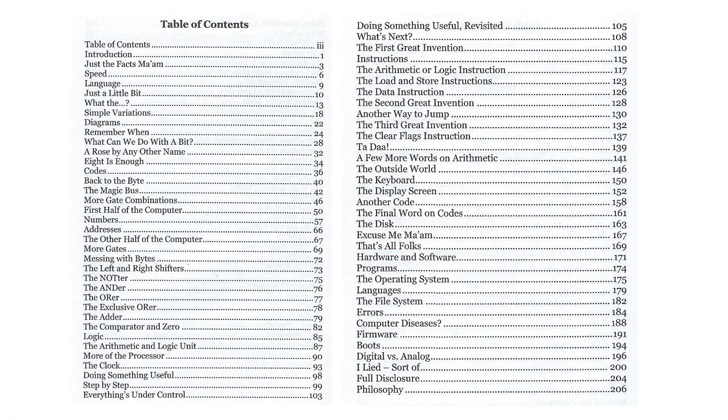Here's the table of contents so you can get an idea of what this book covers. What we'll do is build each component of the CPU and describe it in Verilog HDL, then at the end connect all the stuff together into one processor module. We'll test each module individually and then verify the operation of the entire processor using Universal Verification Methodology, or UVM, and then once we're done with that we'll put it on an FPGA and use it somehow.